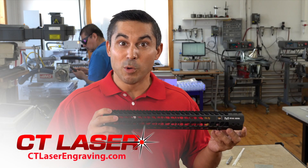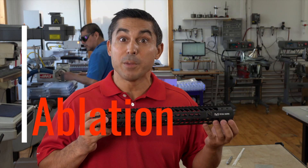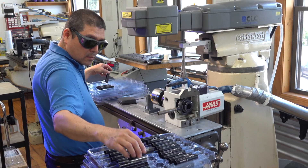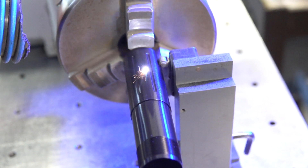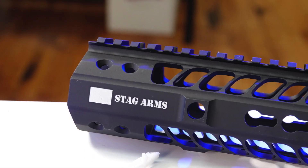What people don't know is that aluminum, when lasered, will turn bright white and will actually appear to be an ink marking. Many people that will see this part at first will think that this was marked with white ink, where in fact it's just the substrate — the aluminum substrate showing through the hard coat anodized.